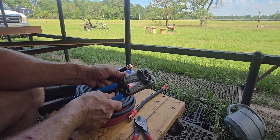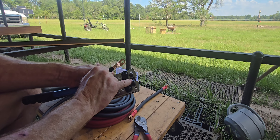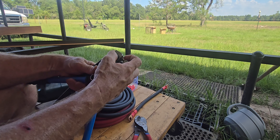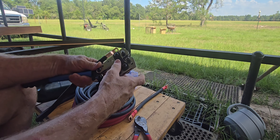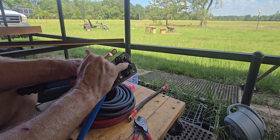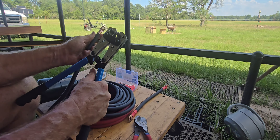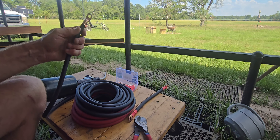Then I take my crimps — this is one-aught wire. What I've found is this crimper — you can push this in and change the size of the crimps by turning this little wheel here. I basically have one side on one-aught wire and the other side on number two wire, because I found that both sides on one-aught wire did not make the level of connection I wanted.